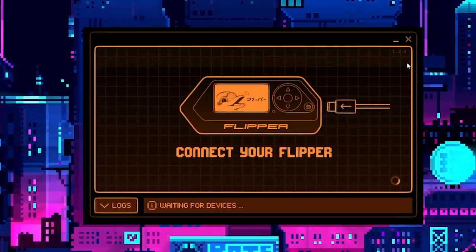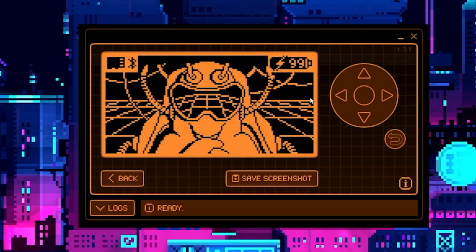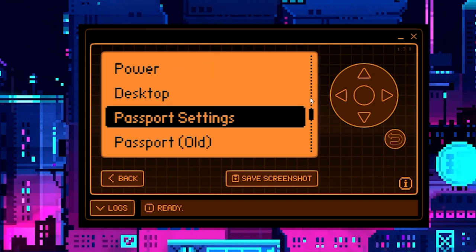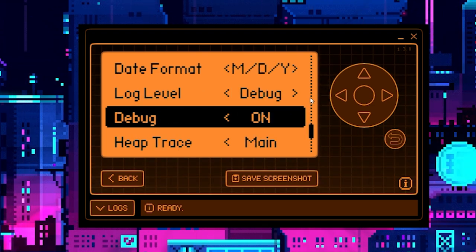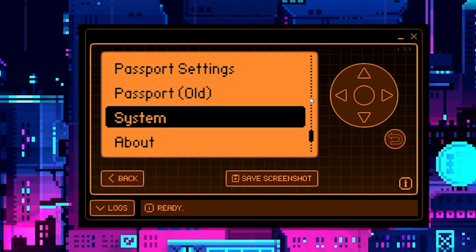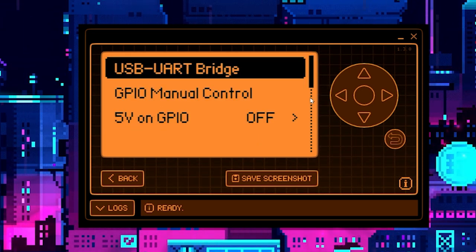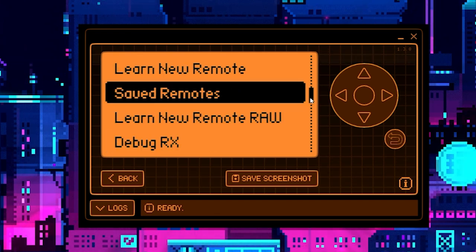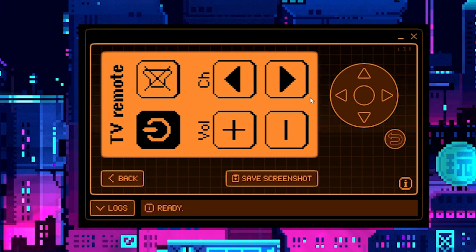There are a few things we have to do on the flipper end. I'm running the latest build of Rogue Master. Now in desktop, I'm going to open up QFlipper so you can watch me. First we're going to enable debugging through the system menu — drop down to settings, go to system, then go down to debug and turn it on. Then we're going to go to our GPIO settings. This uses 5 volt, which is disabled by default, so we're going to go ahead and turn that on. Then go to infrared, then down to the debugging settings for infrared, and make sure that's switched over to pin two, which is A7. With all that done, we'll go up to a universal remote so I can show you what's going on for TVs.